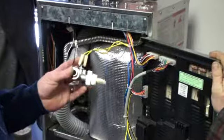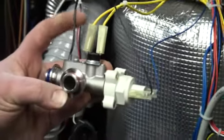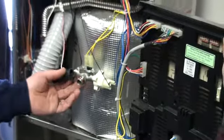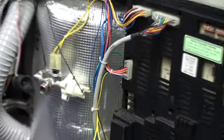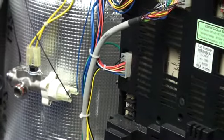If you have any problems with this - ever exceeds 194 degrees, it trips and gives you an error code. The black wire you see there is your NTC sensor for the heat exchanger. So when the front display says H for temperature, that's how it's reading it through that NTC sensor. That pressure switch only functions when the unit is not running - if the PSI drops below 15 PSI, it locks the machine so it doesn't get dry fired in case there's a leak somewhere in the system. Once it's running, it deactivates the switch.